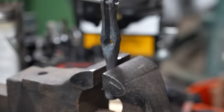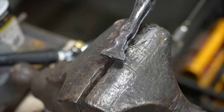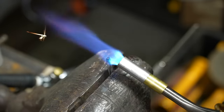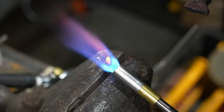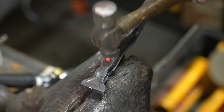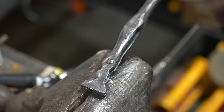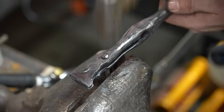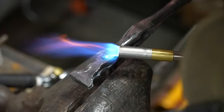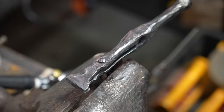I had tried this previously by making the screw completely first, but I realized I needed to do the threading afterwards so I could peen it over without damaging the threads. I heat up the end nice and red hot, then slip the body of the vise on it so I can peen over the edge. Using a MAP gas torch and a ball-peen hammer, I gently peen it over — you can see it gets a nice dome profile — locking this piece in for good.